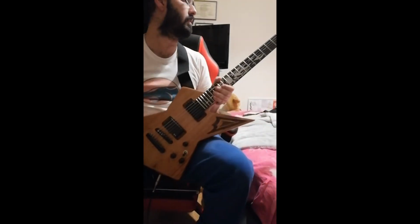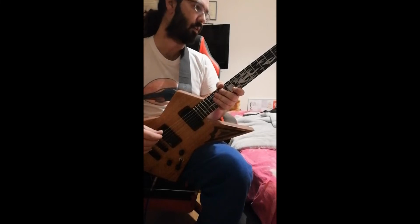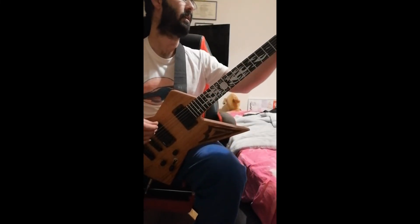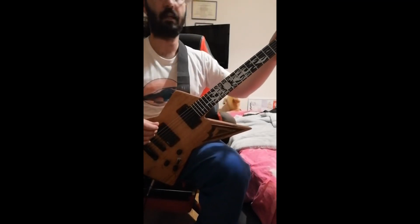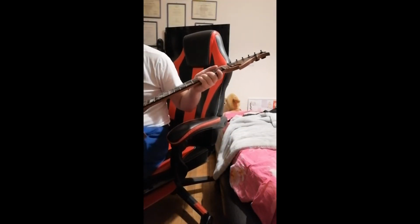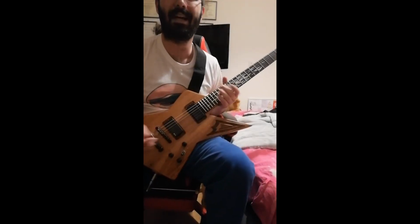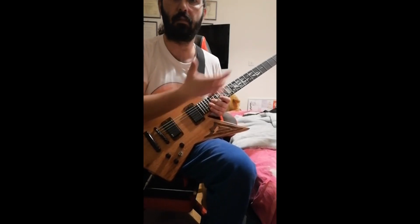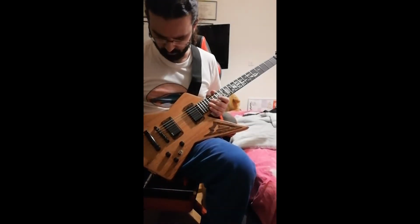Here the sign, it's not a glossy finish, it's matte finished. Also the neck is protected, and I also sanded it with 500 grit in order to have it slidey. I tried to gloss out the rest of the guitar, the body and the headstock. I don't know if you can see it. No, you can't, because it's not that glossed out. You can't achieve a high gloss with teak oil, or at least I can't. It was my first time using teak oil, but I'm totally happy with the whole project.